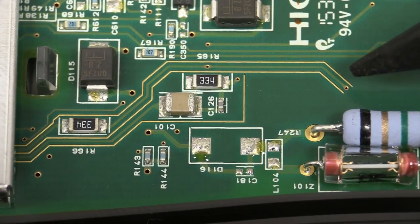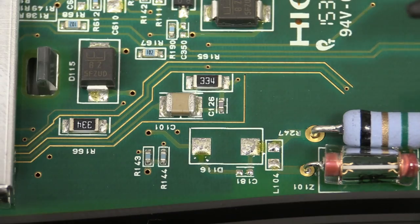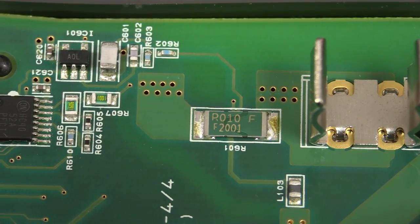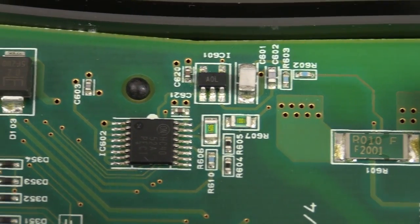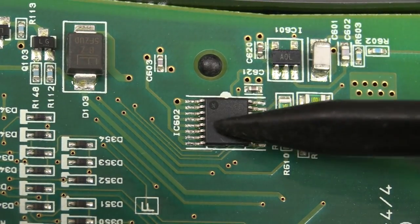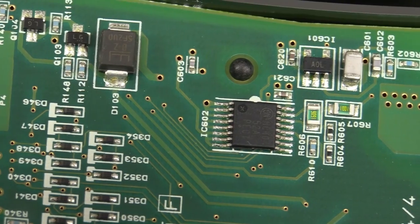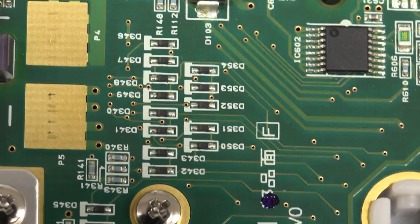Check out the beautiful guard tracing going back here to protect against surface leakage on the PCB — the center trace is what they're guarding against. Very nice. The designers knew what they were doing here. There's our current shunt resistor — R010, 10 mΩ, is the dead giveaway for our current front end. And that IC is the 74HC4052. I love that even these days, jelly-bean 74HC 4000-series switching logic is still used.